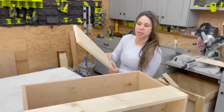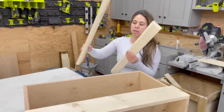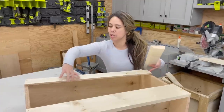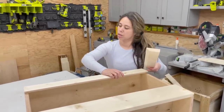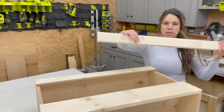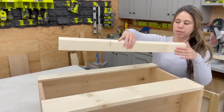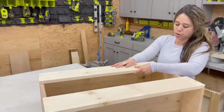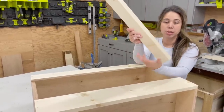This is the one-by-six that I just ripped — you can see the two pieces. How this is going to work is one of the pieces I'll nail to the top, and then the other piece I'll screw to the studs in the wall, and then we can just go ahead and hang the closet on it when we're ready. Now you don't want to do short pieces like this.